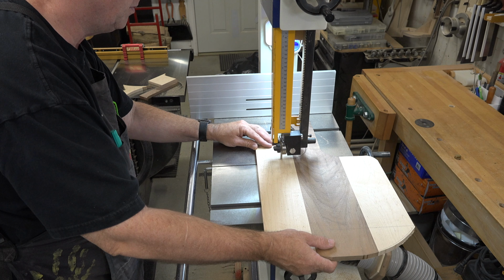Here's what I would suggest though. We used 1/4 inch diameter dowels in 4 places here to help with alignment and as well to give it a little extra strength. I would not plane all from one side. We have 5/8. You take it down 1/2 inch. You're encroaching in on those dowels now.